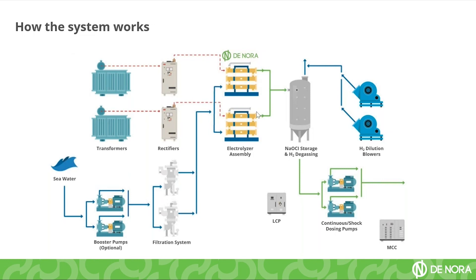The system is also fed with electricity as mentioned. These are transformer rectifiers — your application likely has 380 to 440 volts available, and the Cyclore requires DC current. That is why we include the rectifier here, in order to provide the optimal current for the application.